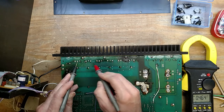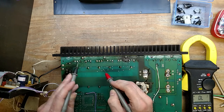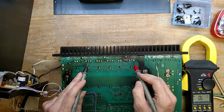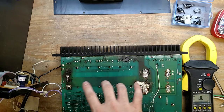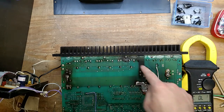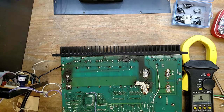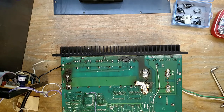These two are complementary. That one's shorted with that one. That one's shorted with that one. You can see on the trace here. And then the opposite will be true, too. So those guys are going to be shorted together, and I get shorted together on the other side of the board. So that's how you know. Every other one of them is in parallel with everybody else, and every other one, again, is in parallel. And that's how you know it's how it's firing the transformer.